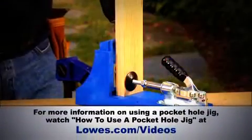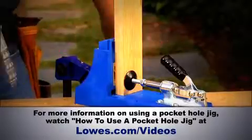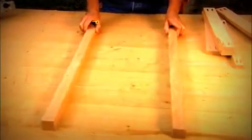I'll assemble one of the face frames, and you can just follow the steps I show you to assemble the other one. The first thing we need to do is drill pocket holes in all of our rails using our pocket hole jig. Now, once those holes are drilled, we can go ahead and arrange all of our pieces in the proper positions according to the plans. Now, you'll notice that the rails are flush with the insides of the legs, and according to our saying, keep the ugly on the inside, the pocket holes also face in.